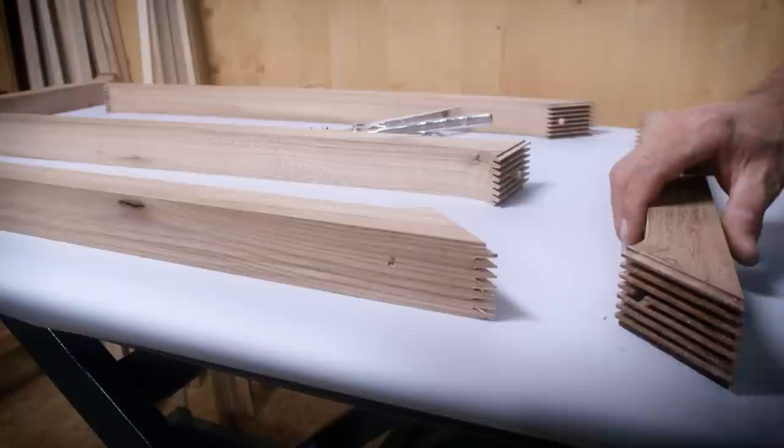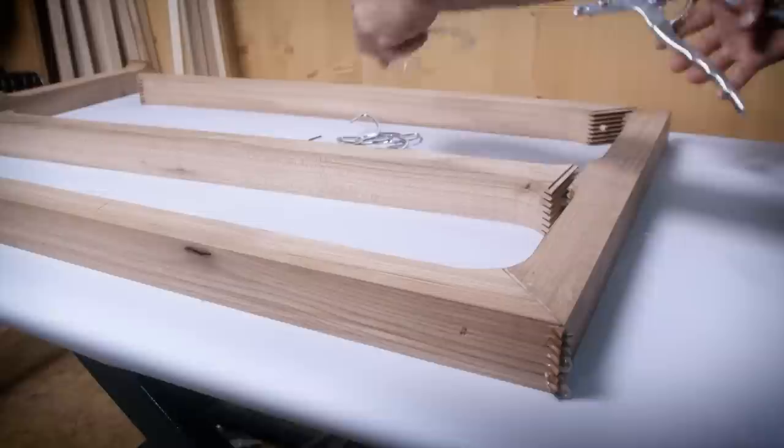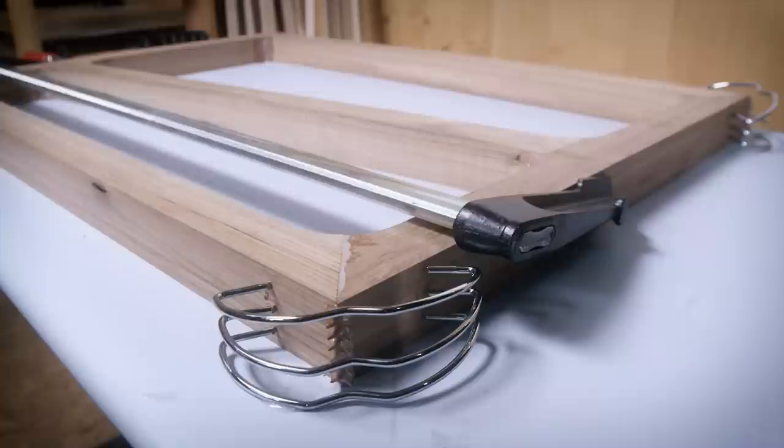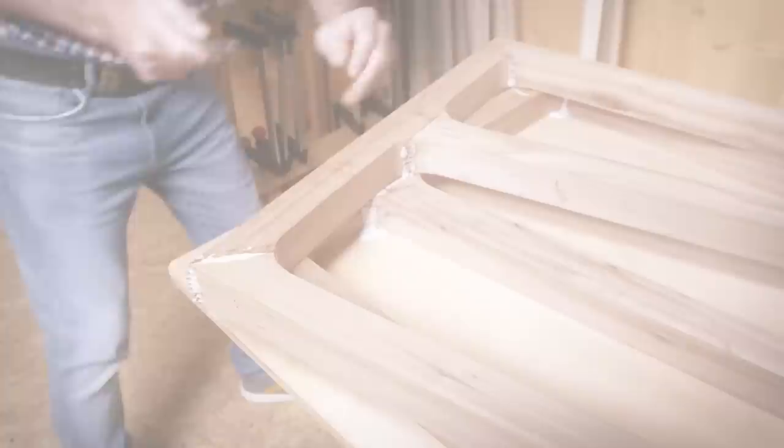The corner joints are held in position with miter clamps. They pull the glue joint together pretty well. The center bar is backed with a clamp. Due to the perfect fit, only moderate pressure is needed. The dried glue can be removed very easily with a sharp chisel.